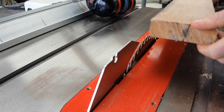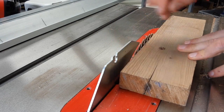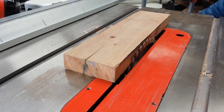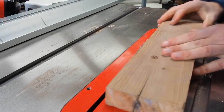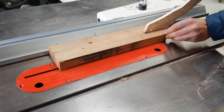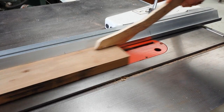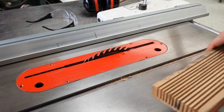I've got a little scrap here and I'm going to do the same thing on the table saw. The first thing I need to do is remove the splitter. Set the depth — that looks about right, it's not crucial. Make sure it's not going to come through. Just to state the obvious, you would never do this with a twisted board on the table saw — without a splitter, anything but straight boards is going to need a kickback sled.